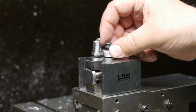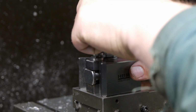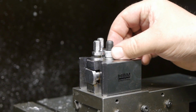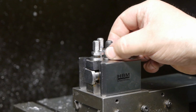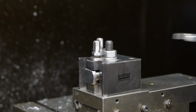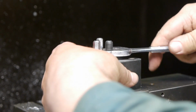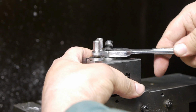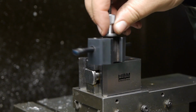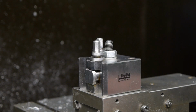It might be a little small for my lathe. The compound slide is a little bit bigger than this block here, and the parting blade holder could not reach up to center height, so I have converted it to a small boring bar holder in my previous video.